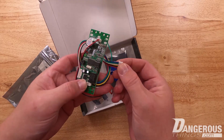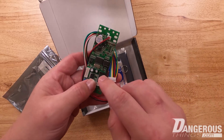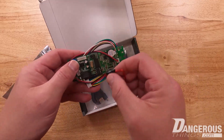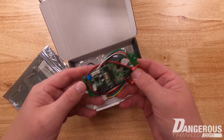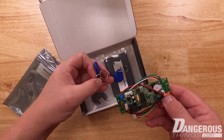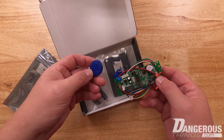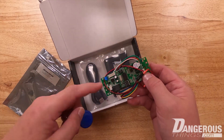The relay has, through the wiring harness, normally open and normally closed contacts, which a good relay should. You can also program the time that the relay stays activated between 1 and 5 seconds with these jumpers here. There's a full video about this product — links and descriptions are below. It also comes with some master tags, so you can program custom master tags to this board in order to do the adding, removing, and managing of user tags — the actual tags that actuate the access portion.